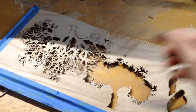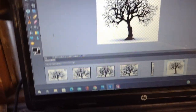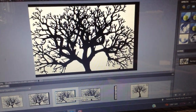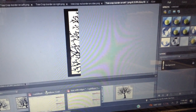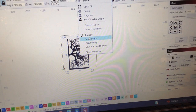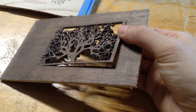I printed out the pattern to start in some quarter-inch oak ply and that worked out great, then I modified the pattern to make it a little bigger because the smaller one had super fragile branches that were breaking. You can see I'm kerfing this material so I could bend it, but the problem was all the material on the edges isn't removed without a border. So in Photoshop I cropped the image down and added a black border on the edge, because this is a 44-inch sheet and my machine only cuts about 15 and three-quarters, so it needs a couple of segments. That black border would allow all the material to be removed. I could upload it into Lightburn, fit it into my size grid, trace it, and that's essentially what I'm going to be cutting.